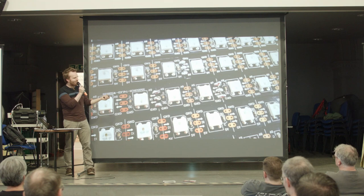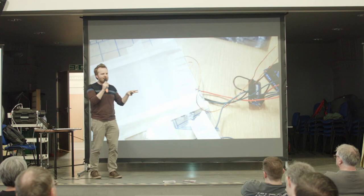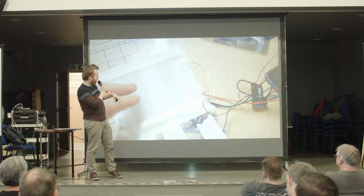Right, so LED, so I talked about the WS2812B, 74 per meter. I think there are 9 rows of them. This is me testing out some touch sensors. I wanted really nice touch sensors, and I actually just tried some copper wire, and it's just going behind this sheet of what I'm just using for diffusion. You can see I'm testing it, and I test it away from that as well, and it seems to be working through that material.